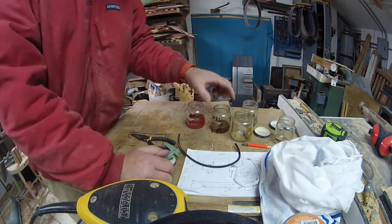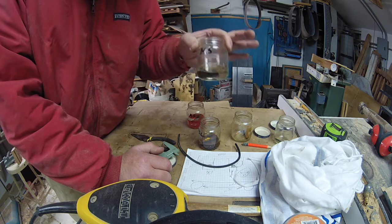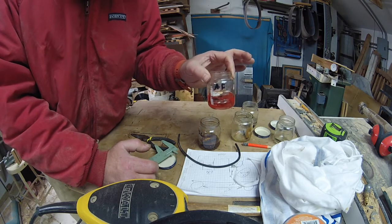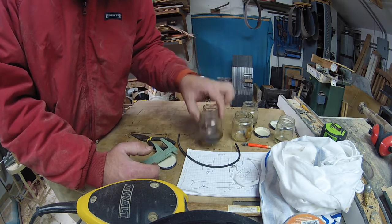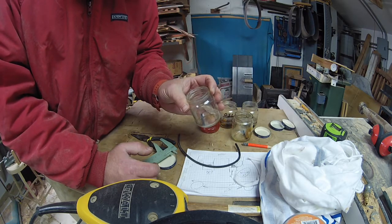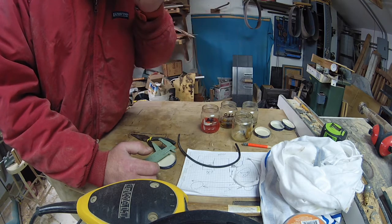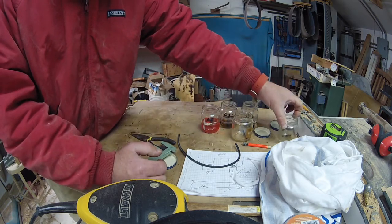As far as things that damage the O-rings: oil shows some reaction; mineral spirits shows a lot of reaction with a clear weakening of the tensile strength; running the SCA additive package has not affected them in any way — that's not surprising, considering that's what Cummins specs. Motor oil softened them up. I think we've got to throw the lacquer thinner one out — there's some residue in the jar, it no longer smells like lacquer thinner; it smells like soap. We've got to toss that one out of the mix.